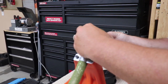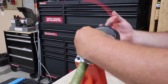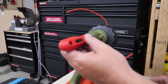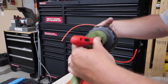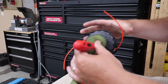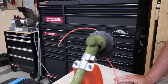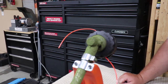Put that on and take your Speed Feed and wind it counterclockwise. Now take your screwdriver again, find that hole where it catches, and turn it to tighten. And now you have installed your Echo Speed Feed 400 to your Husqvarna 525L, 525LS, or 525LST. Hope you enjoy.